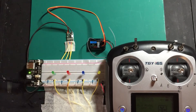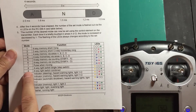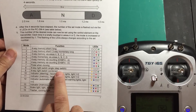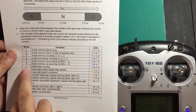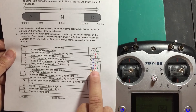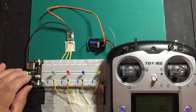I've done a separate video of how to do this, but we're going to look to put the unit into Mode 8, which is the 4-way light switch, single step switch — that will become more apparent in a minute. We're looking to have a yellow flashing LED. The unit should currently be in Mode 7 from the previous video, so it should be showing blue, red, and green flashing. We're going to put it into programming mode.